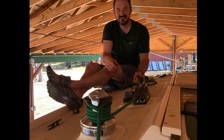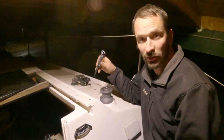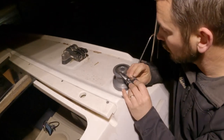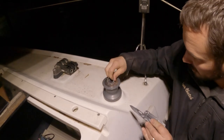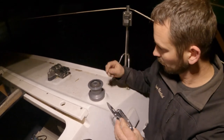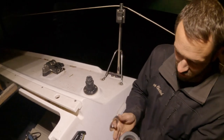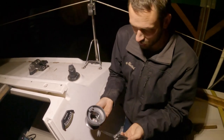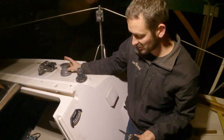The self-tailing winches were a great solution. Now I'm going to try to take off the other one. To remove this, there's just a spring ring — not really a split ring, but a spring ring. Then remove the outer drum, just a top piece on there, a couple of pawls. Pretty simple, no gears, no anything — it's just a very basic winch.